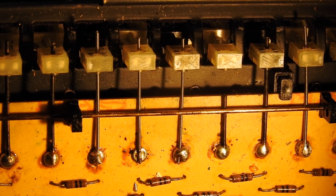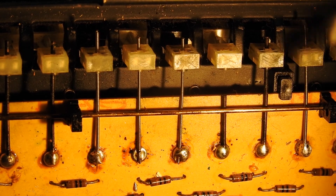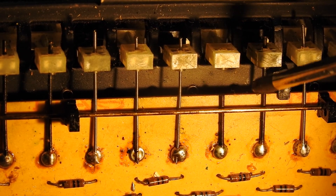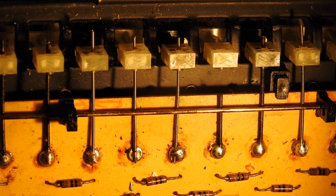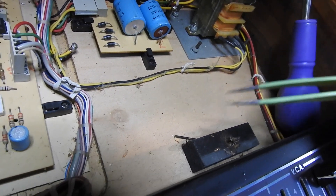The A key that we found was not working is this one here. You can see that the J-wire is actually broken — I suspect it's down inside the keyboard. That's a definite broken one, and I think what I need to do is mark the keys so we know which ones are playing up. There's that broken J-wire — I don't really want bits of metal floating around inside the keyboard.